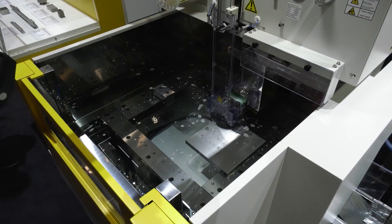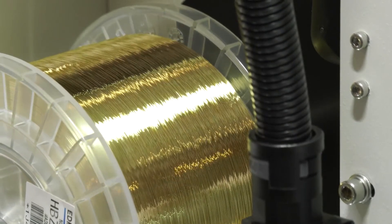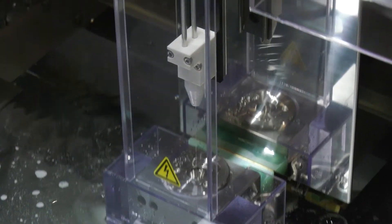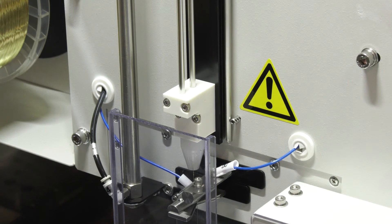What sort of accuracy? For taper cutting, it's very accurate — we can achieve 10 microns or less. You've got different diameter wire options — the standard wire size is 0.1 to 0.3mm. We also have an option for thin wires down to 0.05mm diameter, available as an option on the 400 small machine.